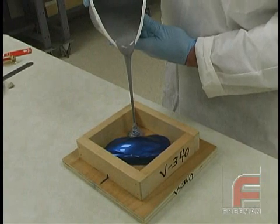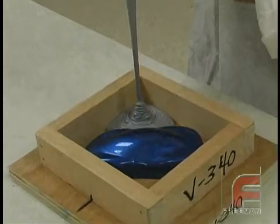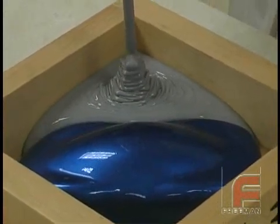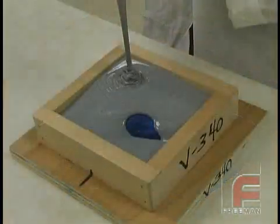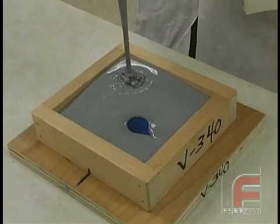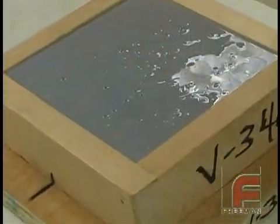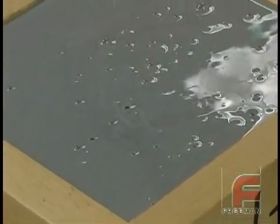When pouring a silicone rubber, you want to pour it at a low point first. Notice that this is thicker than a urethane like Repro. When you pour the material, you do enter a little more air into the mixture, but these bubbles will break on their own. This mold will take about 16 to 18 hours to cure. An addition cure rubber can be accelerated only by heating it; a condensation cure rubber can be accelerated chemically.